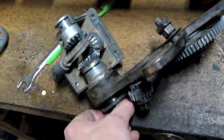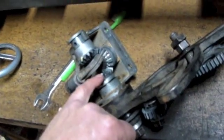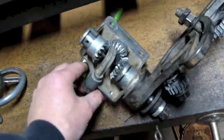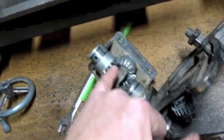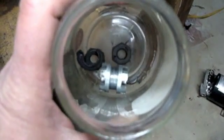This is the driven part right here. There's a gear that goes on this that drives it and turns through here — that's the one that will reverse the direction. This is constantly driven in one direction by the motor and gear train. Then there's a clutch dog that goes in the middle, and depending on which way it's shifted, it engages one side or the other to change direction.